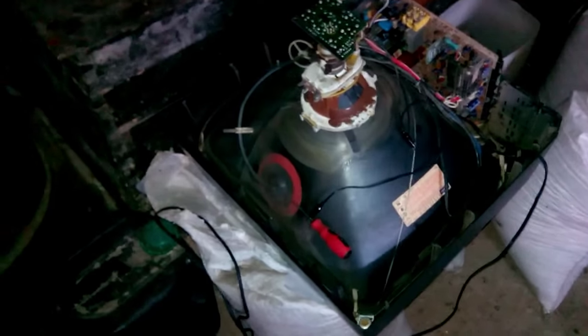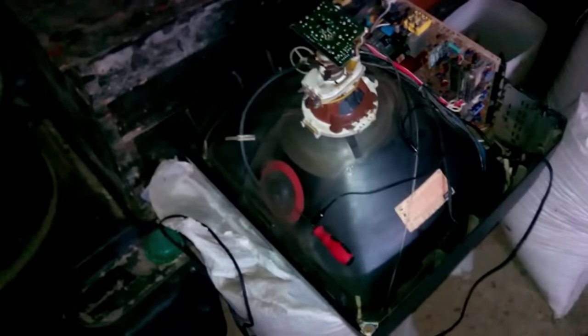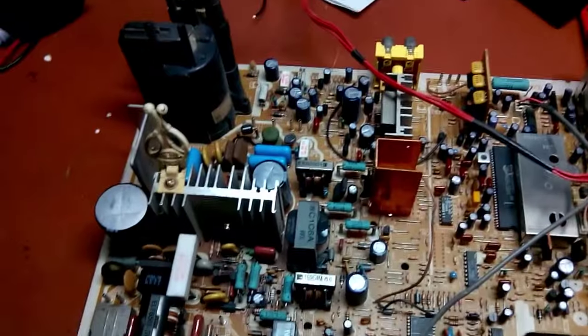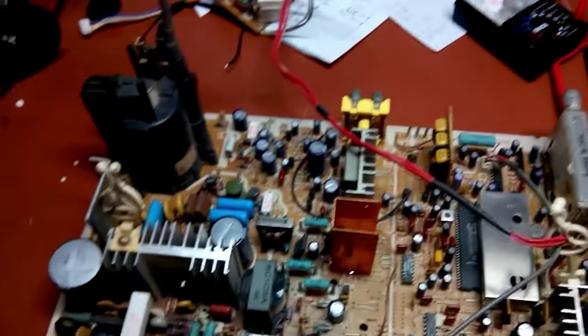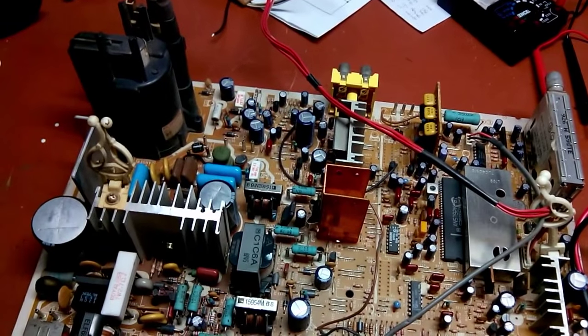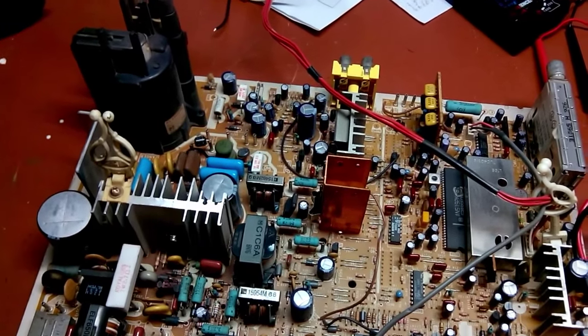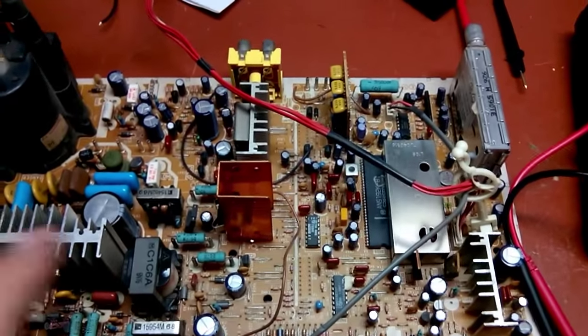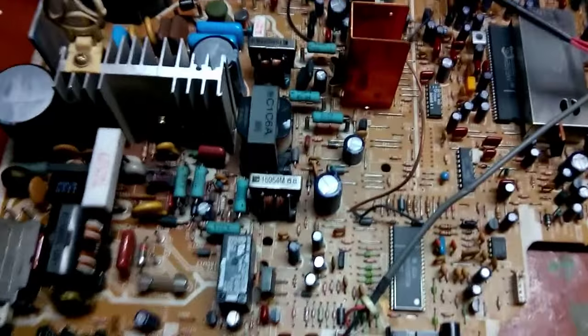You'll hear a click — probably barely, but still a nasty shock. Make a nice contact and leave it. By the way, the picture tube can restore its charge even after you've shorted it out, so leave it a while. I did a quick research online and found that similar Panasonic TVs suffer from a problem where a protection diode on the secondary side shorts out.